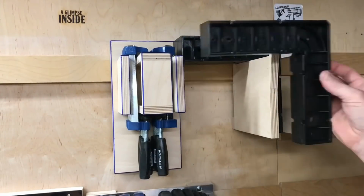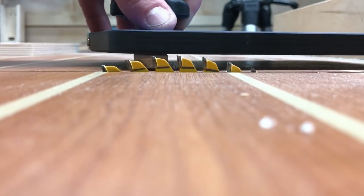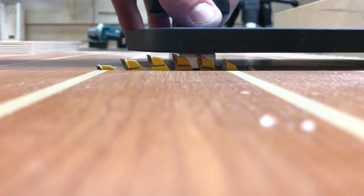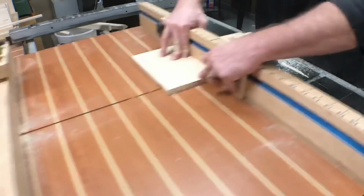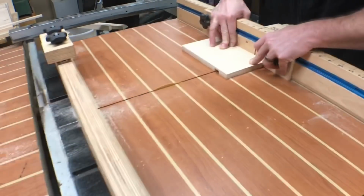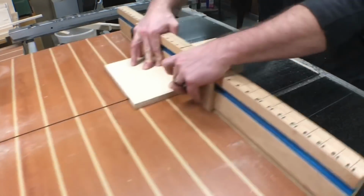So off camera, I made this bracket that's holding these 90-degree angle brackets that coincide with those clamps, but there's a space there that's underutilized. So we're gonna go to the table saw and we're gonna cut a dado in a piece that's gonna hold a thin rip table saw jig. Making multiple passes using those stop blocks on this crosscut sled.